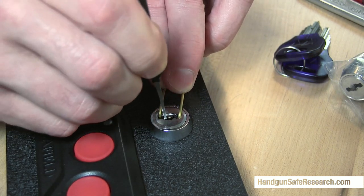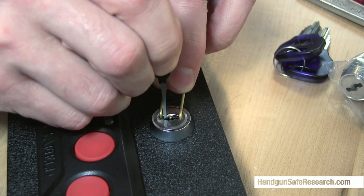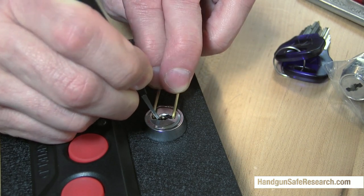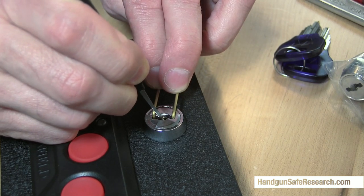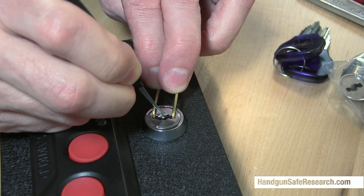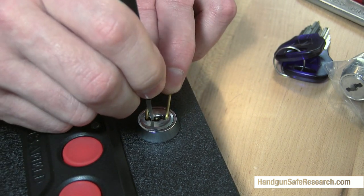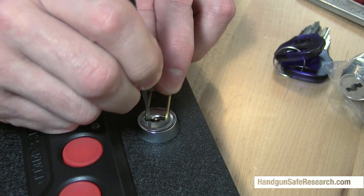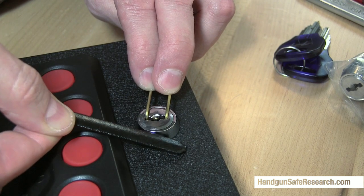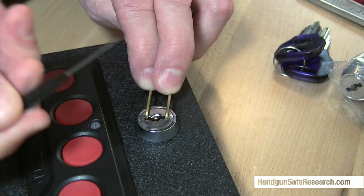These are odd locks. They have these brass rings. You can tension one side of a lock like this, go through and set the rings, and fool yourself into thinking you're picking the lock. You'll get everything set, the lock is not turning, and you'll wonder what's happening. It's because these rings get canted at an angle. You can have them all set down one way, but you have to go down the other side of the keyway to push on them, and then they get canted in the other direction — you just go back and forth.